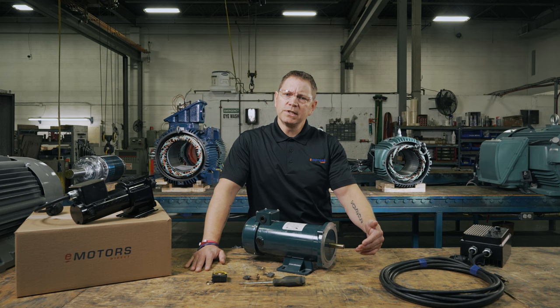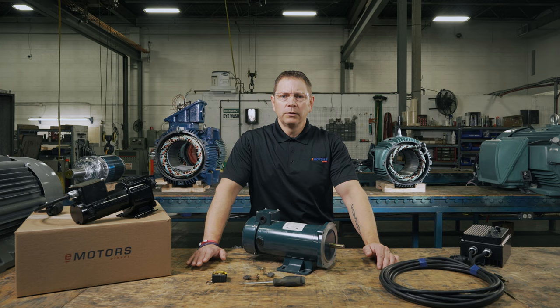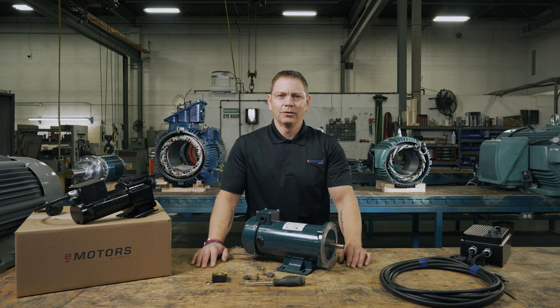Your motor will have two to twelve brushes in total. Once you're done checking or replacing all your motor's carbon brushes, operate your motor at no load to test it. You can use some seating stone to help the brushes seat quicker. This will allow the brushes to fully seat before running under load. To seat your carbon brushes means to have as much contact between the edge of the brush and the commutator as possible. The more contact, the less chance of arcing, which would cause damage to the commutator.